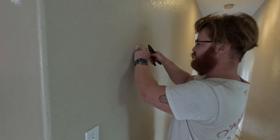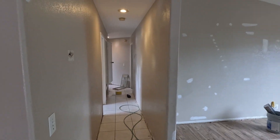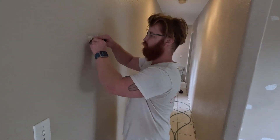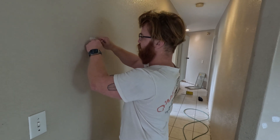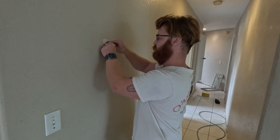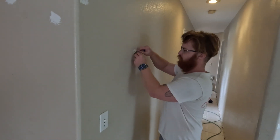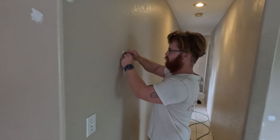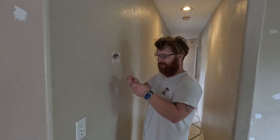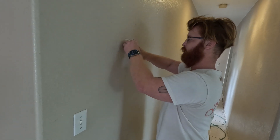This is way more common than you'd think. If you have a smart thermostat working intermittently, check your wire gauge. I've had service calls where someone says they've been having issues ever since they went to a smart thermostat — and it's just this. People will get a smart thermostat, get frustrated, and put their old dumb thermostat back thinking the smart one doesn't work, but it ends up just being the wire the whole time. The ones I've seen it on most are the Nests.